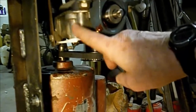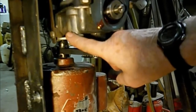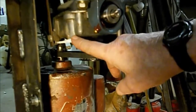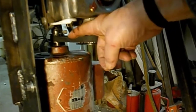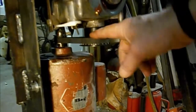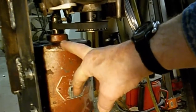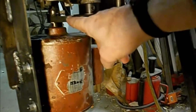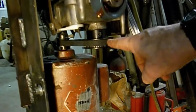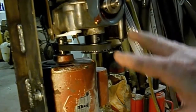If you remember, this is a three-speed transmission — here's the lever to shift it and it's in low speed right now, which seems to be a pretty good position. I also got a half-inch wide belt, and I changed from the quarter-horse motor to a half-horse motor. So we've got the drive gears changed and we've got a good solid driving system now.